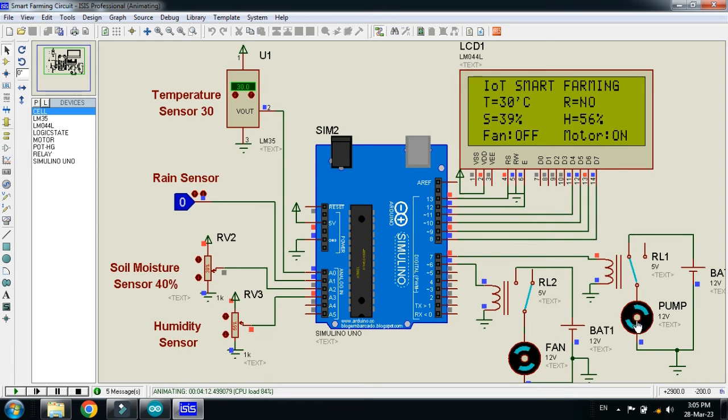When rain stops, the pump will start again. Another situation: if it is already raining and the soil moisture drops below 40 — you can see 42%, 41%, now 39% — the pump is still not working. It will only turn on when the rain sensor reads zero. Here you can see whenever the rain sensor goes to zero, the pump starts because the soil moisture is at 13%, meaning the farm needs watering.